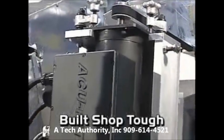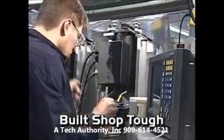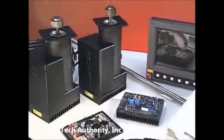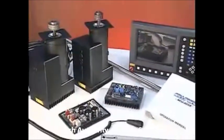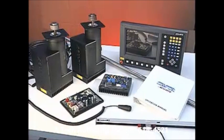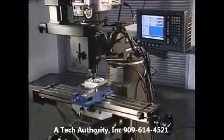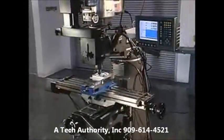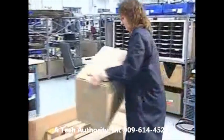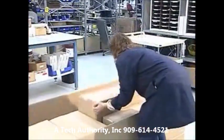Mill Power's closed-loop system includes components that have been tested and manufactured to withstand the harshest machine shop elements. These components include precision ball screws, heavy-duty servo motors, die-cast metal enclosures, conformal coated reading heads, and certified calibrated precision glass scale linear encoders, assuring accuracy, repeatability, reliability, and overall system performance. This complete control package is installed by your local factory-authorized AccuRite Mill Power Distributor, and within as little as eight hours, you're up and running.